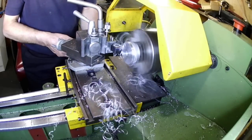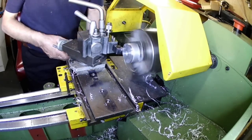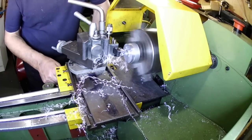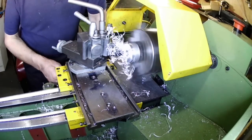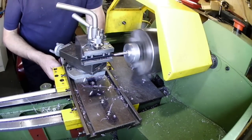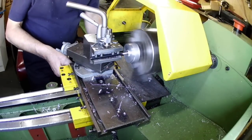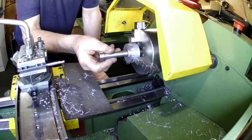To hold the plate true on the index table, I'm making an adapter to hold the index plate while I drill all the index holes. There's nothing too spectacular about this adapter except that both sides must be parallel to one another. It'll have 2 spigots on it, one to neatly and snugly fit into the index table, and the other must be a nice firm fit into the index plate at 25mm.